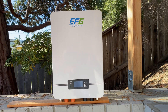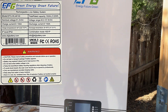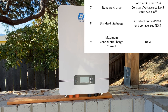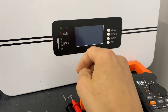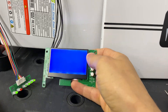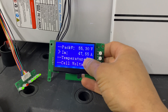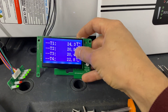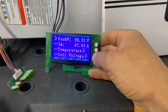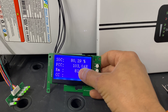The specification for this battery is 51.2 volts, 100 amp hours. On the side we can see operating temperature and the recommended charge and discharge current at 0.2C which is 20 amps, and the maximum charging and discharge current is 100 amps. On the front cover we have LEDs to check state of charge, any alarms, and battery status. We also have a screen — pressing it shows a welcome menu. In analog info we can see pack voltage and current percentage, and on the temperature screen we can see data from four temperature sensors on the cells.